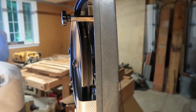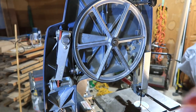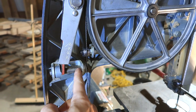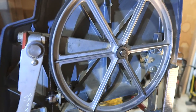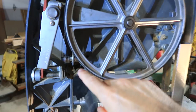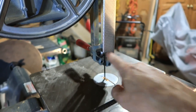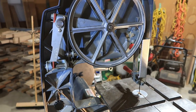With these two bearings cleaned and re-greased, it runs quiet at last. No more squealing. But lots of shaking. This is my neighbor Reg's bandsaw, and it's kind of weird. The tension is adjusted with this lever thing, and there's a nut sort of thing on the screw, and an allen key comes in from this side to adjust the tension. Whoever designed this bandsaw didn't know, or didn't believe in crown pulleys, because these are completely flat on top. So what it does is it just tracks backwards hard against the bearings. There's an extra thrust bearing up here to make sure it doesn't come off the back of the top wheel, plus the normal bearings down here and here. Personally, I think it runs a bit too fast, but it's already at the slowest that the Shopsmith can go.